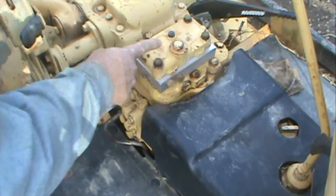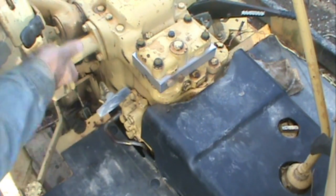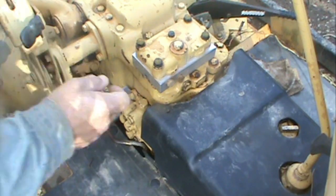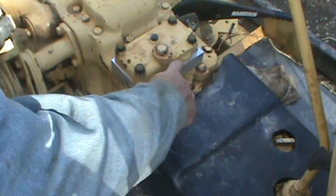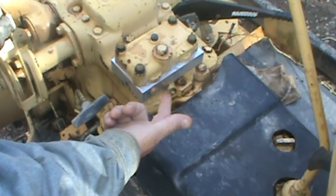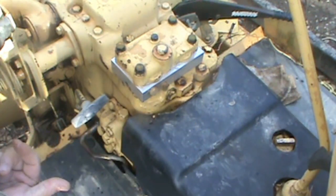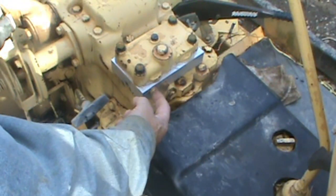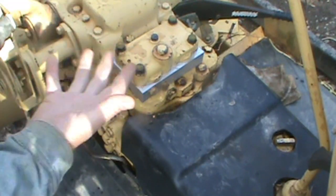Here's the plate. This is the original block-off plate for the blade arm, and this is a control for the blade arm right here. The way they've got it designed, it steals hydraulic flow from in here, sends it to where you need it, and then lets it go back in here - actually here - to operate the hand valve and the lift.